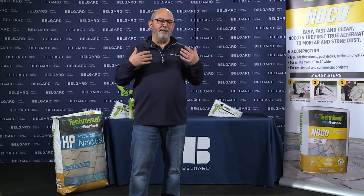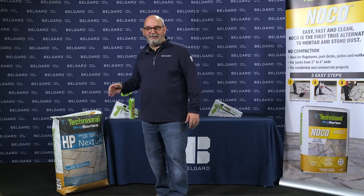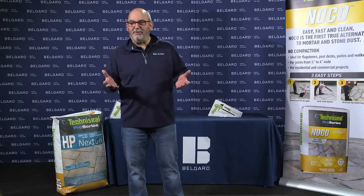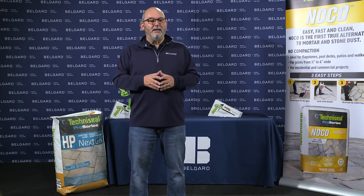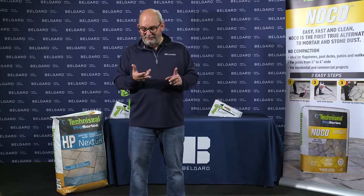So all the memories you have of dumping bags, sweeping, compacting, dust everywhere, doesn't exist anymore. So this new generation, no dust. That's what you need to remember. The same things that you know now about polymeric sand are true about this generation as well. Let's run through them quickly. 50-pound bags, 70 to 100 square feet per bag, depending on the size of the joints. Needs to be compacted, wants to be compacted, won't work unless it's compacted, and watering is critical as well.